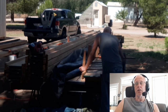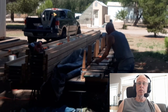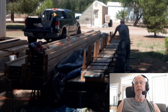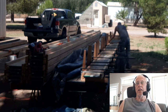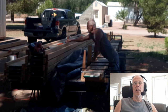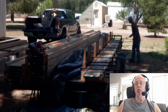A lot of people say you can't build these things yourself because they're engineered — it's an engineered I-joist, so for some reason it's taboo to build it yourself. Now I wouldn't put these in a second-floor structure, even in my own house — well, maybe if I worked out some of the bugs — but the reality is they're pretty sturdy. You can find DIY trusses and even some two-by-four I-beam-looking things with 2x4 top, bottom, and webbing.